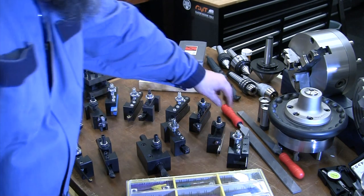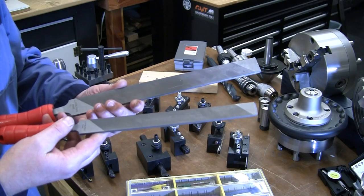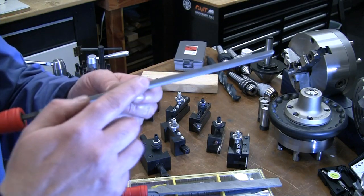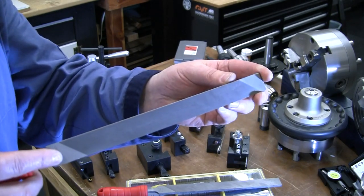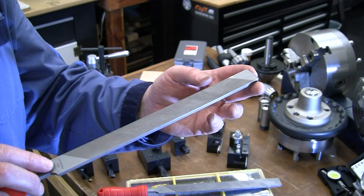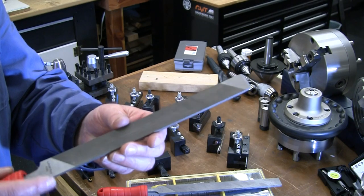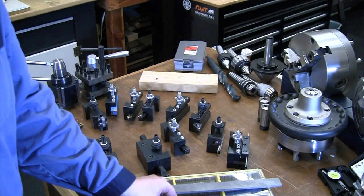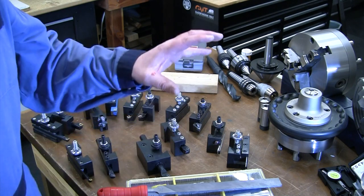The last item on the bench: lathe files. I'd recommend having at least a couple on hand. The lathe file is a slightly different angle than a regular file and has no filing teeth on its edge — so when you're working on the lathe you're less likely to bump and interfere with another part of your workpiece. It's handy for touching up a corner, cleaning up a radius, or knocking off a burr or sharp edge. I like Nicholson files — picked these up on Amazon. There are lots of options; I happen to be partial to Nicholson.